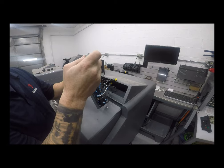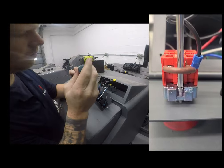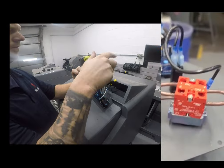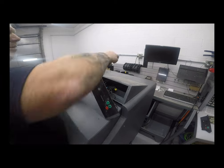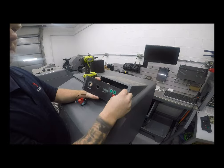Next, there are two screws that hold the e-stop button in. Loosen those with your Phillips screwdriver and this will allow the button to be separated. Gently turn your e-stop button to the left or counter-clockwise and the front will pop off, releasing the back.